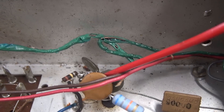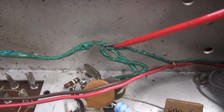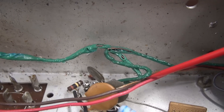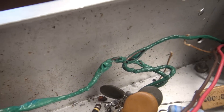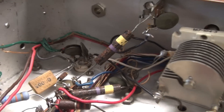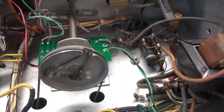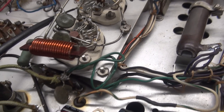Near the oscillator tube, the wire did get through the insulation at a tie point in the harness, but once again, luckily, it did not melt into the other conductors. Following the smoke path, you can see all the wiring on this half of the Viking 2 has the melting, but if you go on to this side it wasn't affected, which is kind of strange. That will at least cut half of the work out for me.